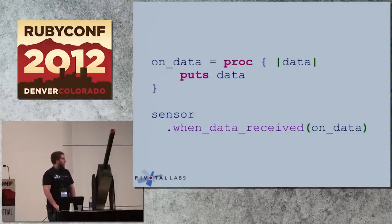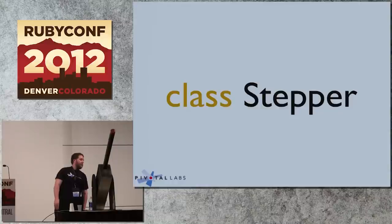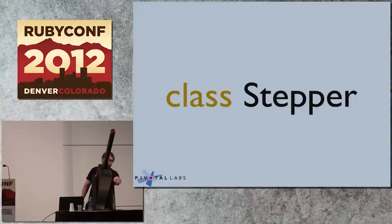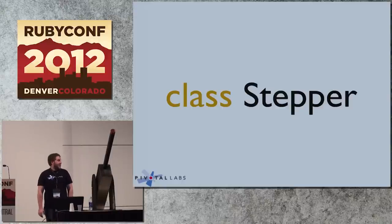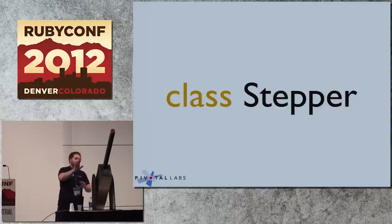Finally, another pivot wrote the stepper class, which I use on the cannon. I'm really bummed, actually, it's right here. It's a little stepper motor. I had this thing with full pitch control from a website, so you could aim it at yourself. And then when it got off balance, the motor wasn't powerful enough to pull the cannon back up. The way stepper motors work is it's four electromagnets and it pulses them to get a wheel spinning. And actually you can provide more power to a stepper motor and it gets more powerful, unlike a DC motor, which can't do that. But I provided way too much and I fried everything. I actually created a little fire. It was neat in my hotel.